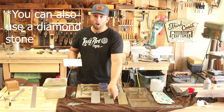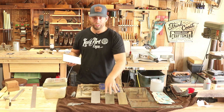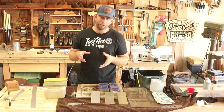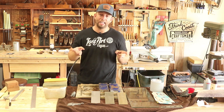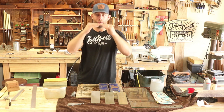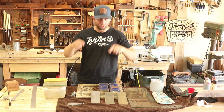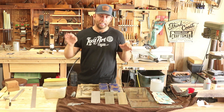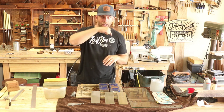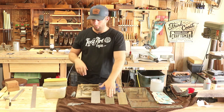When I bought these, I also bought a coarse diamond stone. The reason I bought a coarse diamond stone was for when I had heavy duty material to remove and also for shaping the outside edges of my plane blade. You want to add either a full camber to the whole blade or keep it flat across and round the corners, so that when you're planing you get a feathering effect on the edge of your plane blade stroke, so you're not getting visible lines.